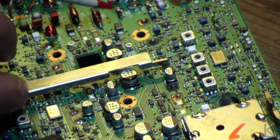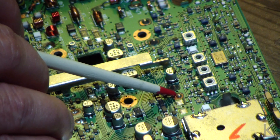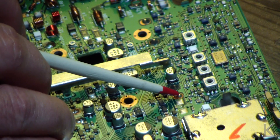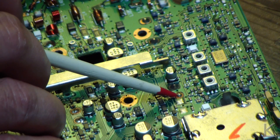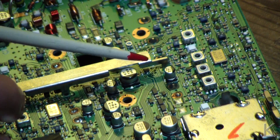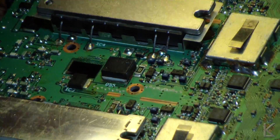This one looks okay. This one's halfway, but this one right here — there's more flux around it than solder. The solder's just on the wire; it's not even making to the pad. So that could be our problem there too. The soldering iron's almost heated up. We'll redo these solder connections and then get the radio back together and see if that resolves our issue.